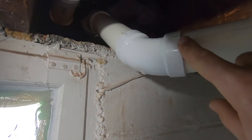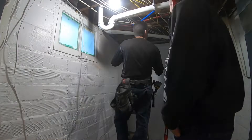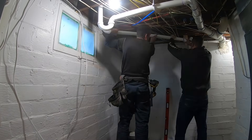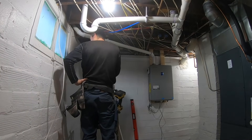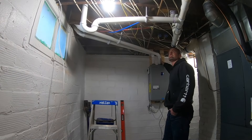I make my marks on here so that when I take this apart and glue it back together, I get it all back in the same spot. Now that we have it dry-fitted and all my marks made, I take it apart piece by piece and glue it together, starting at the water heater and working my way to the outside. Then I just repeated the process with the exhaust portion of the pipe.